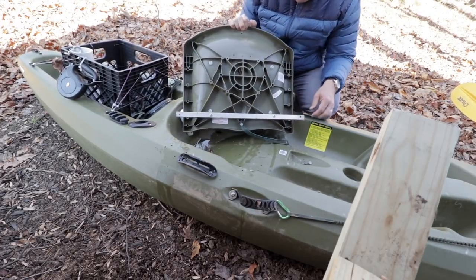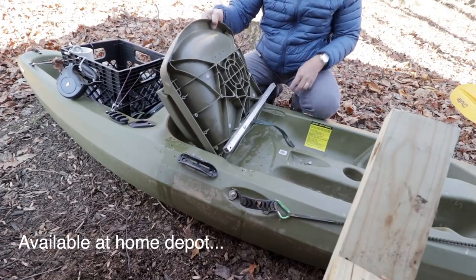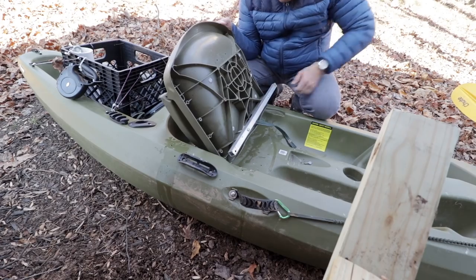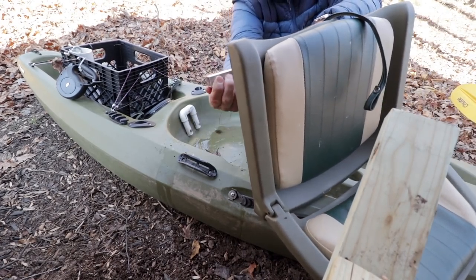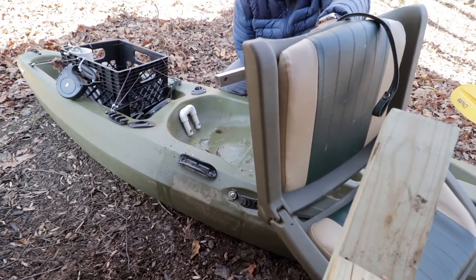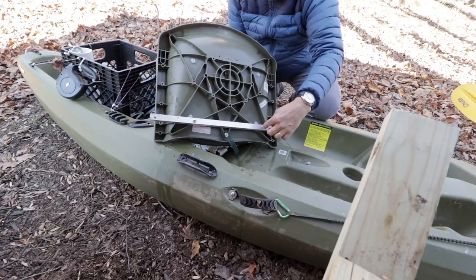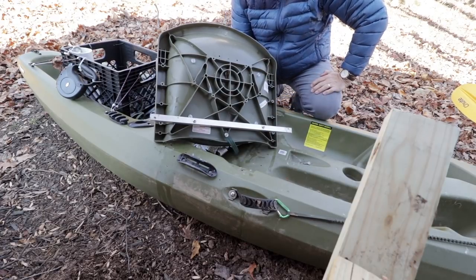Here's how I made it work. I took an aluminum bar and fitted it across to match these two holes in the kayak, which are already quarter-20 threaded. I drilled out the bar so I could put those threaded screws down into those holes and screw it down to the kayak. Then I made holes in the aluminum channel and ran screws up into the seat, connecting the bar to the seat. That's the front section.